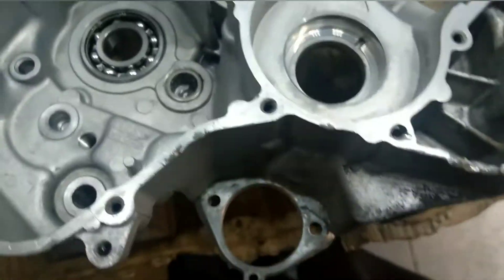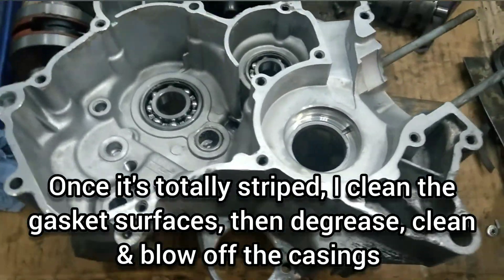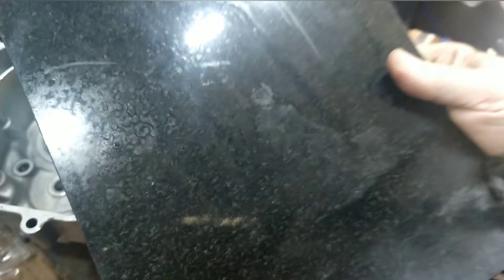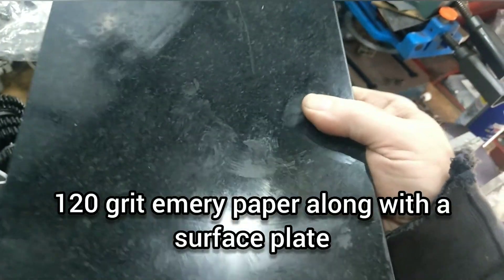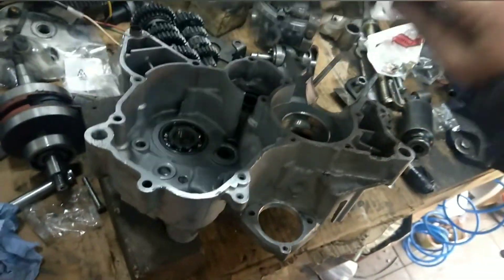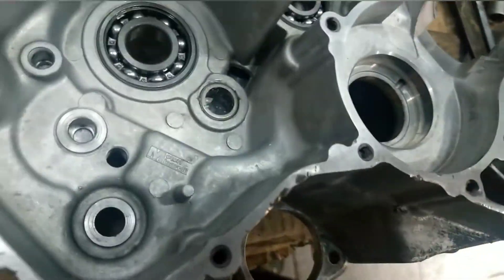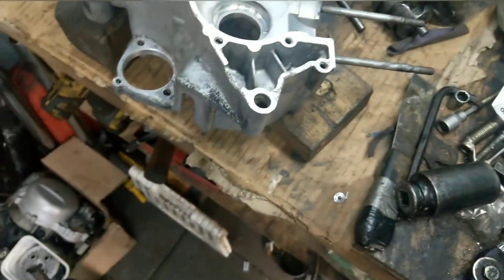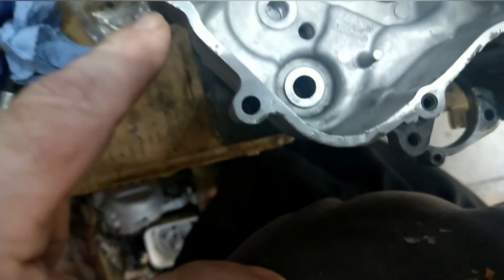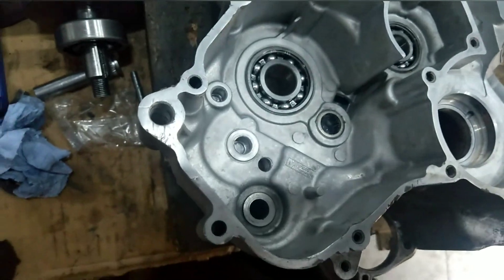I'm sure I've shown this — it's had a good clean up. How I usually do that is get a sheet of emery paper and put this — I call it a surface plate, it's basically an old granite chopping board — and you just put it on and slide it back and forward so you've got to make sure everything's nice and even. After that you have to make sure you've got a good clean out and blow out — you don't want any grit left in it. Just check and make sure there's no high spots on the casing. There's some of the casing that's a wee bit chewed up — that's what happens when folk try to stick a screwdriver in to separate the casing.